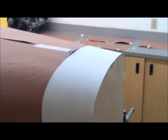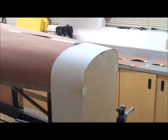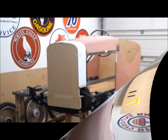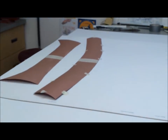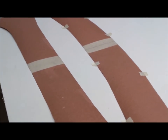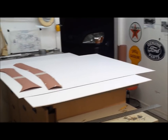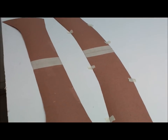I think I'll do some other pieces before I start hacking up expensive aluminum. Since the piece that goes over the radiator worked out from the pattern, I thought I'd try to do another one — this will be the piece that goes over the top of the cowl. Here's the pattern I used for over the radiator — it fit pretty nice. So now I'm going to cut out this one and see how it fits. I taped it down with some scotch tape and traced it with a pencil, then I'll cut it out with some heavy scissors.